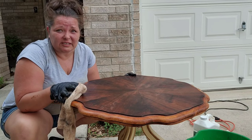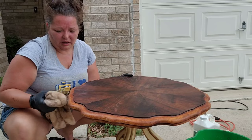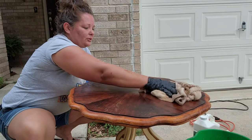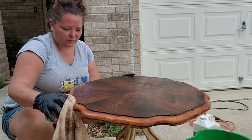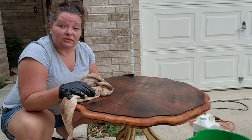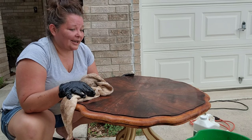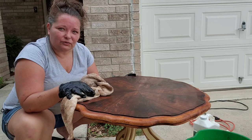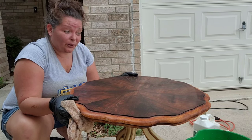I've just cleaned this with low-odor mineral spirits. I've gotten underneath multiple times and all around the edges. I used a little bit of water. I do think there are a couple of small spots where the finish didn't come off, but it's quite thin. I'm going to rinse this with a little soapy water and then some regular water, then let it dry and compare the three options: sanding, oven cleaner, or wood stripper.